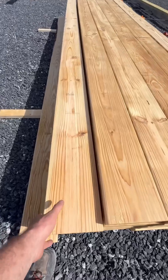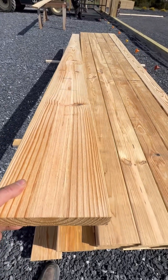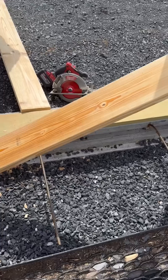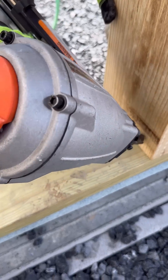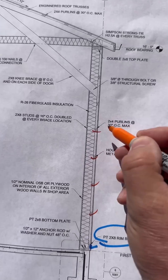The studs for this building are 16 foot long southern yellow pine 2x8s. Because these walls are so tall and heavy, the guys frame them in place. Four ring shank nails on both sides of each stud. Next, they install 2x4 girts 30 inches on center.